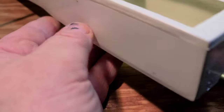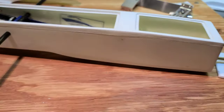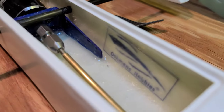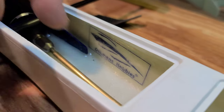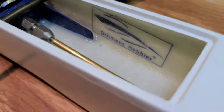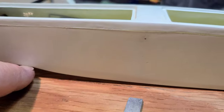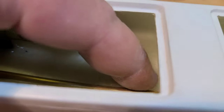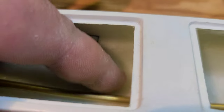The hole looks straight to me. Now we've got to put our little bend in it and get this epoxied in. Let's check our work on the setup board — basically made for this purpose. Our stuffing tube is coming straight out of the collet, riding the shaft. You can see our AOA angle right here where the hull comes up to the front of the tub — that's basically our angle of attack.